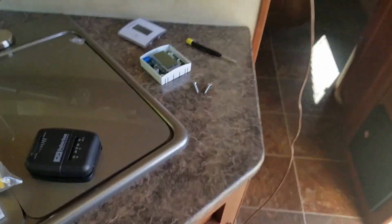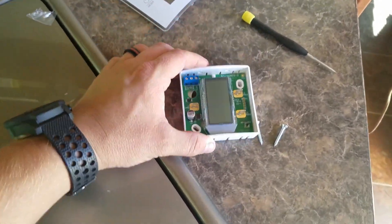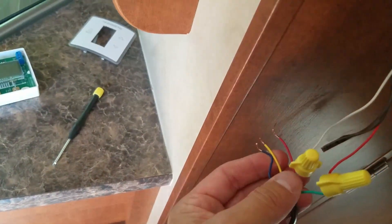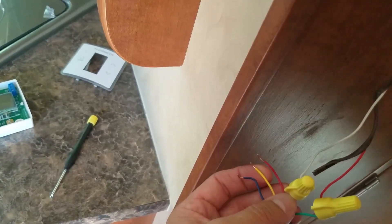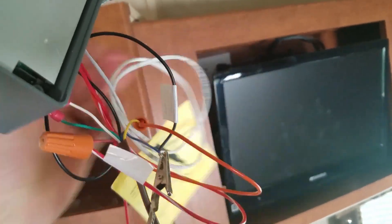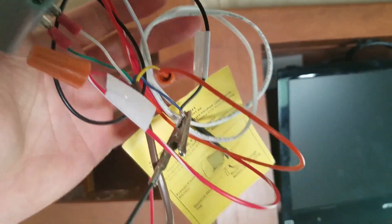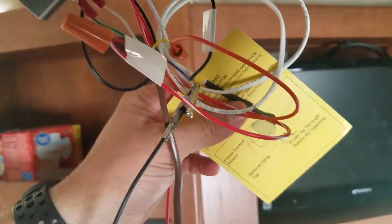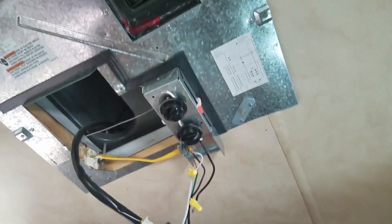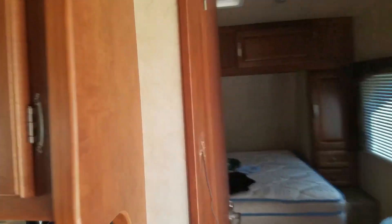Just to review: we are going to have a total of three wires coming into the thermostat unit — our ground, our communications, and our 12-volt supply. On the thermostat wire end, blue is ground, yellow is comms, and red is supply. We also have a freeze sensor that comes out of the control box with a blue plug — all that does is ensure the coils aren't freezing. Just unravel it and stick it up into one of the fins near the bottom. I connected everything and it's working as it should.